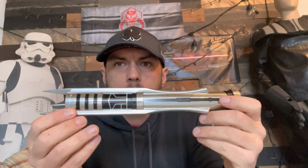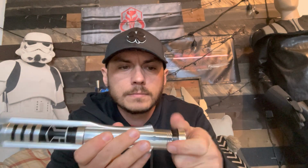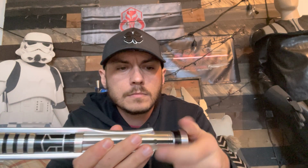And then we'll go through taking the chassis out one more time. Same as we did before, but we'll just do it on camera real quick so that you can see how to do it, right? So the blade comes right out. Remember when we're taking this guy out, one more time, make those switches face the bottom so gravity drops that auxiliary switch. And then we'll just come over here and unscrew this. With those switches down, this thing pulls right out, just like that.